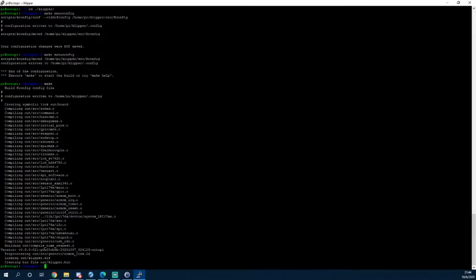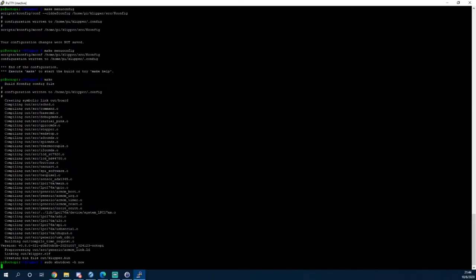What we're going to do now is turn it off. We will reconnect to this in a few minutes, but what needs to happen in the interim is we need to take our Pi, plug it back in to our printer, and put the two micro SD cards in the SKRs. Leave the SKRs unplugged, the USBs unplugged from the Raspberry Pi. This is important. Because what needs to happen is we need to start it up, go through a couple of steps to determine which SKR is which for the Klipper config, and then we can connect them up.